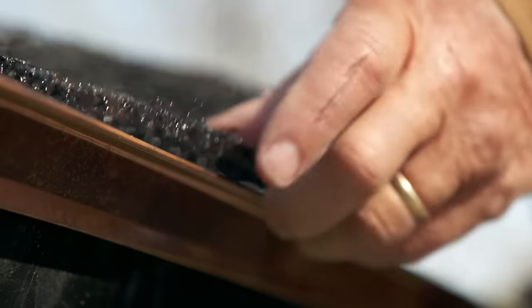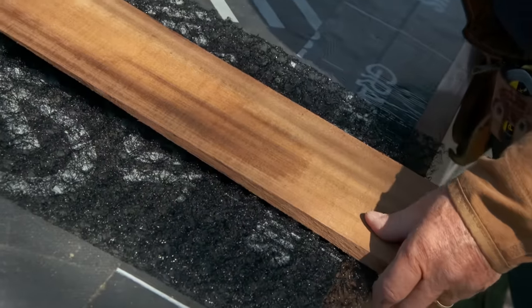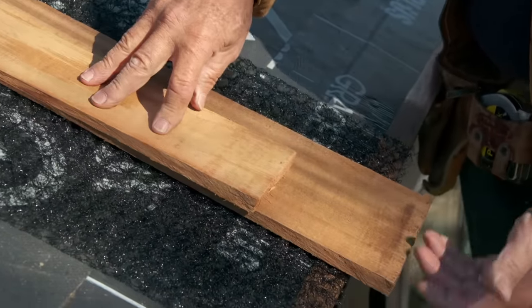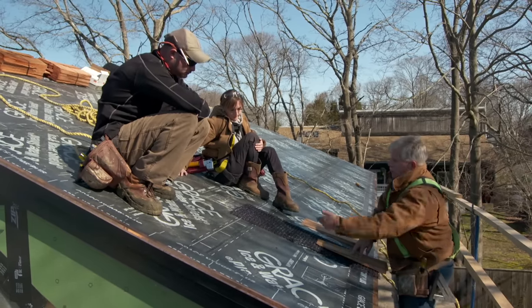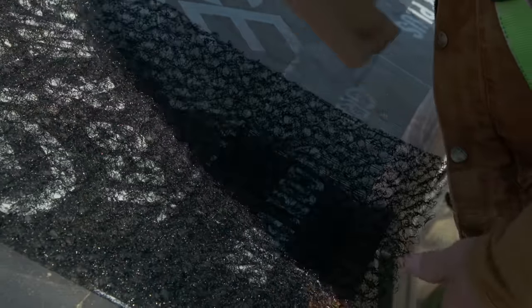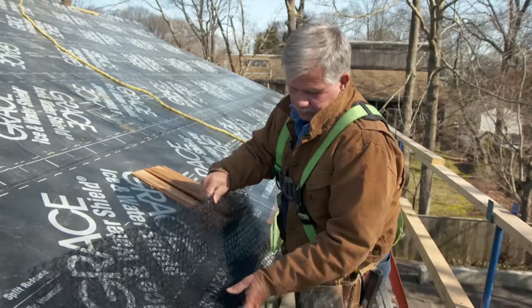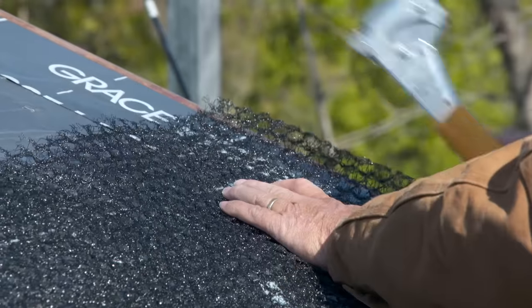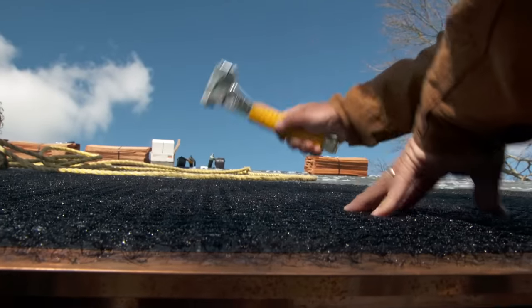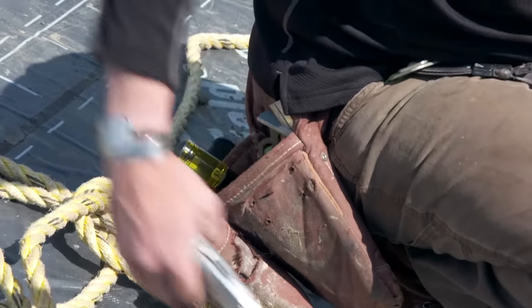To solve that problem, we're actually going to use a breather material — a nylon matrix that you lay on the roof. The shingles will sit on that, on a bed of air underneath them, allowing them to dry because air can come up under here and across the sides. That's how you make a wood shingle last. So the first thing we want to do is install our matrix across the bottom. We're going to roll this out and staple it right to the roof sheeting — about 24 to 36 inch squares just to hold it in place until we install our shingles.